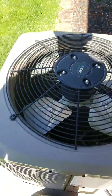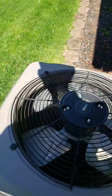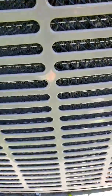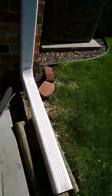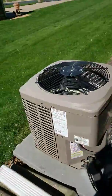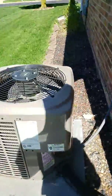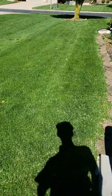Let's just say that these units didn't have the best reputation. Because as you can see, this unit right here has a microchannel coil. You do not want these. You see those little lines? Yeah, that means less refrigerant. I've heard these units have lots of problems, so try to avoid the microchannel units like this as much as you can.